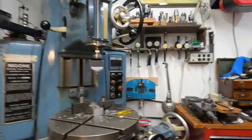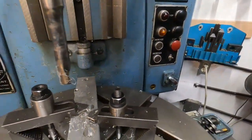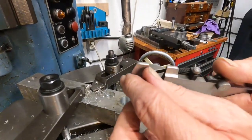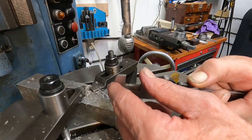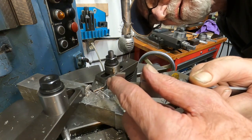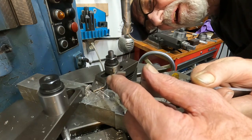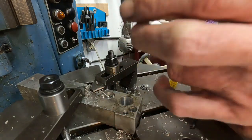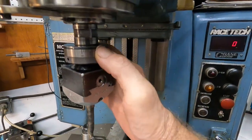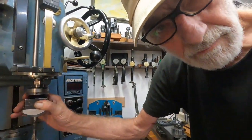What did I do with that — there it is. I'll take and measure that hole. I hope you can see it; it's got a nice finish. It reads .705. That took out 2 thousandths. So it says 20 on the dial — that's 20 ten-thousandths — and this dial has a range of 30, meaning 30 ten-thousandths, which is a 3 thousandths total range. That's pretty interesting.